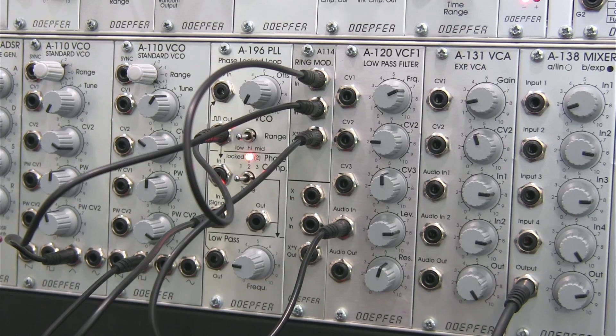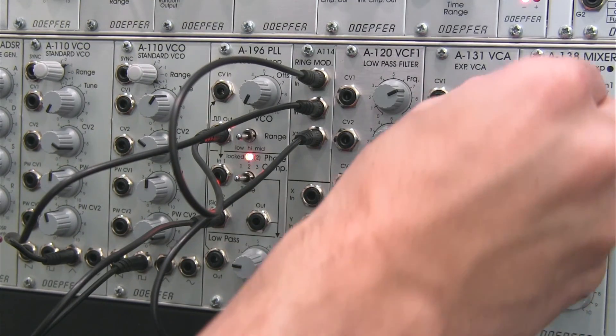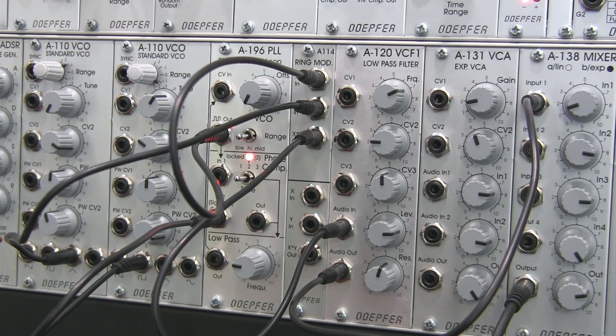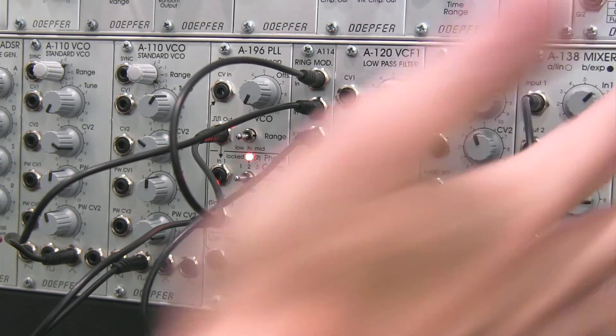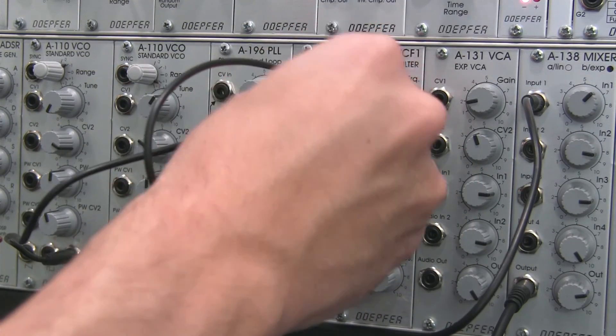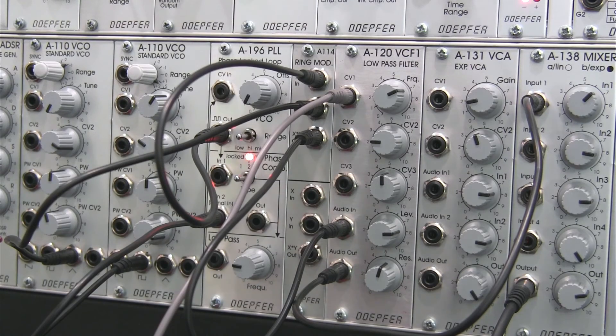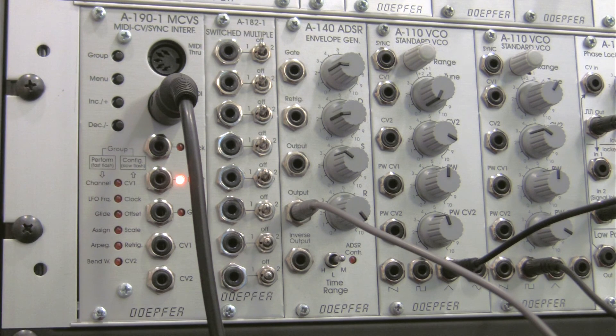The low-pass filter is going out from here and over into our mixer. You can hear a small amount of sound — my level is fairly low, let me bring it up so you can hear the basic signal. The other part of this is the envelope generator going to the control voltage of the low-pass filter. We're starting with just the basic sound that's on the website so you can hear what it sounds like, and then we'll add my spin on it. The sequence is coming in — just watch the light and you'll start to see and hear some activity.